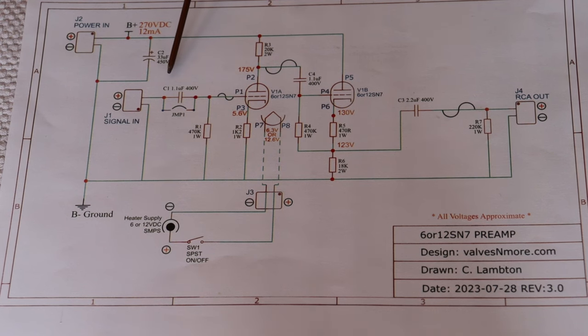Capacitors all color the sound. The ones we put in our kits and prototype builds are relatively neutral sounding, but they all have a very small sonic shift. They're also very clean, clear-sounding caps, and it's worth the little bit of extra money. None of the capacitors in any of our kits are exotic, yet every single piece of equipment we've ever designed and built — including prototypes — are all in the audiophile grade of sonics. We sweep our equipment in great detail and spend hours listening. I can tell the difference between our coupling caps, but only just slightly.